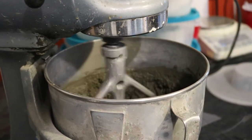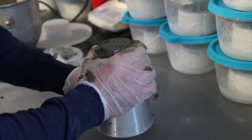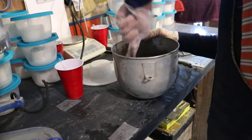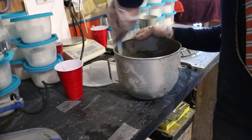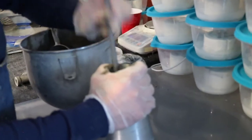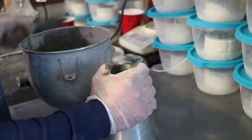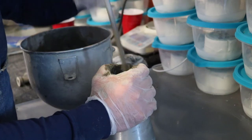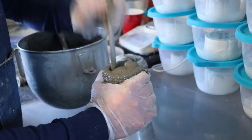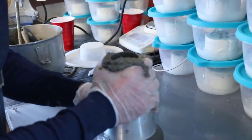To do that we have to run 16 mixes, and even a small mix is a lot of materials, so we ran a preliminary mix first. We used the ASTM C1260 proportions: 440 grams of Portland cement and 990 grams of sand, bumped up by about 25 percent so we'd have enough for our mini slump cone. We ran our water-to-cementitious ratio at 0.43, which was around the middle of our range. We started with no high-range water reducer to get a stiffer base mix, then slowly added high-range water reducer — first at three milliliters, which was optimal, and you can see the slump increasing significantly. Then we added another three milliliters and you can see the grout totally pancaked out with even a little halo, which is exactly what we're trying to capture with this project.